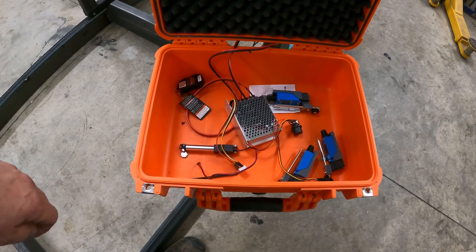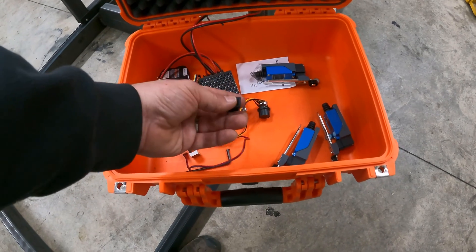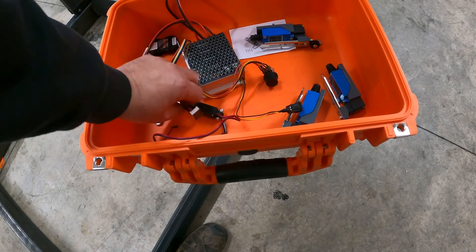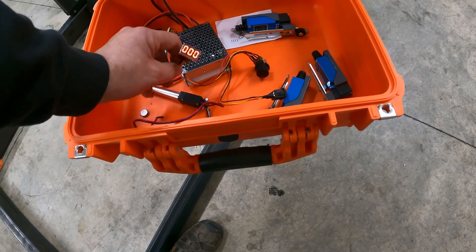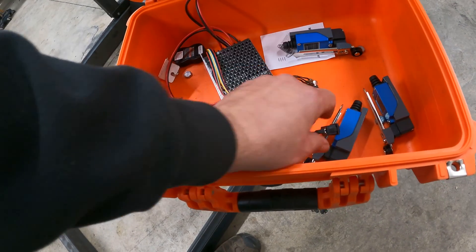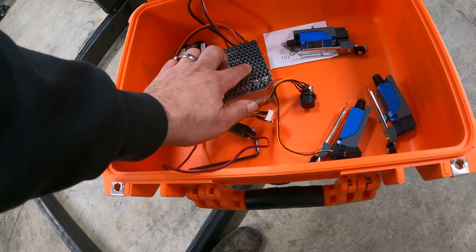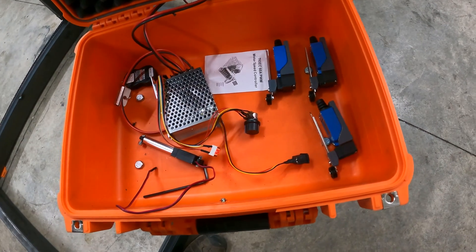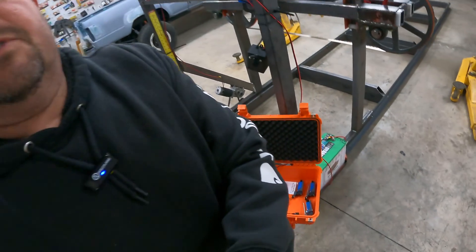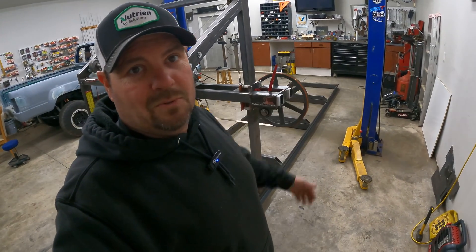This wiring is nowhere near complete, but this speed controller is what I've got it hooked up to. It's basically just an on/off power switch that comes with a speed control dial, and it's also got a little digital readout that will tell you how much you've got — it'll go zero to a hundred. And then this is your forward and reverse. I'll put links to this in the description. I've also got some limit switches here that I'm going to incorporate to the front and rear stops and wire into this speed controller. That way if for some reason I trip and fall or something happens, it's not just going to run off the tracks or keep going forward at the end of the rails.